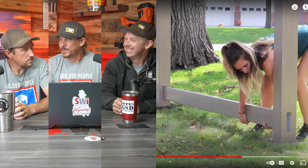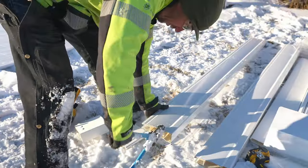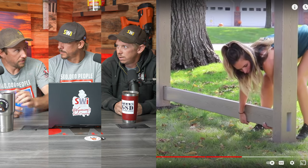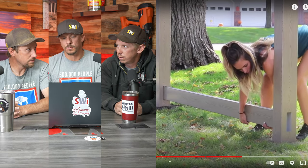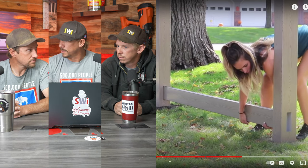Go the other way. Those are called notches. Yeah, and they're absolutely important in the bottom rail. And you can get rail notchers, so if you need to trim this down. But if you're doing a no-dig system, you don't have to notch your bottom rail. No, because it's locked between the two posts, so no notches necessary. In fact, the notches just irritate me more than anything.